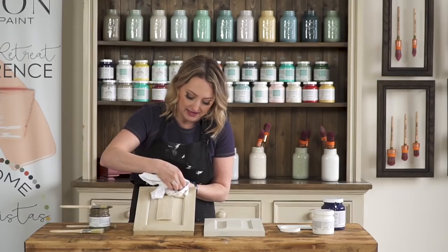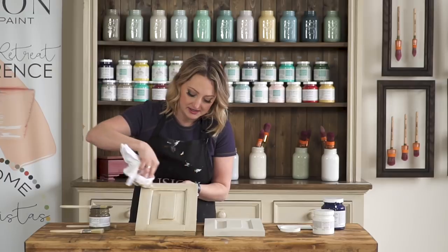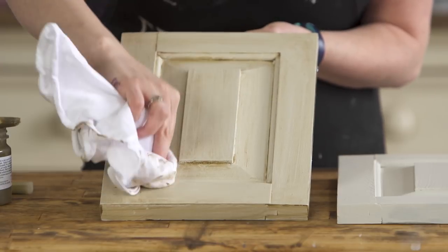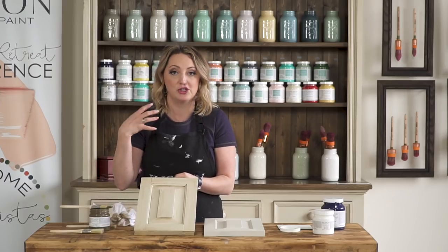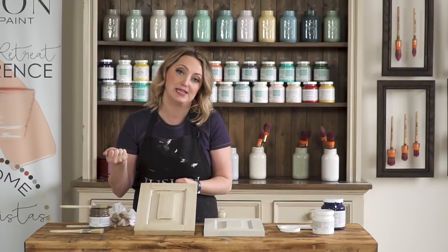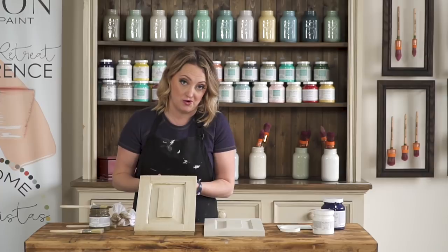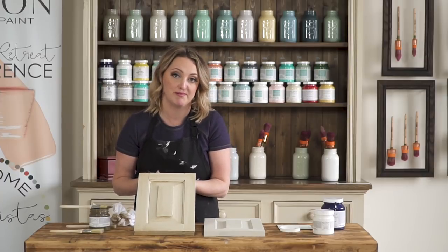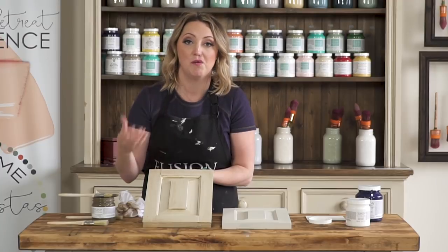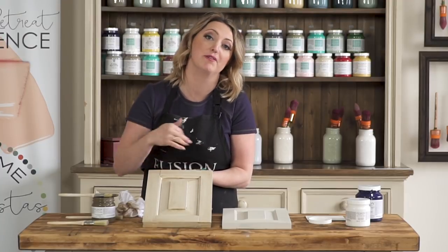What we must keep in mind is that the glaze has a very long open time and it's not as sturdy and durable as the paint is itself. So you actually will want to add a clear coat top coat onto this. I recommend using the Tough Coat, which is the non-yellowing clear coat that is water-based. You want to wait approximately 24 hours after applying the glaze to put anything else over top of it, because if you add anything too soon, it will reactivate it — any water-based products will reactivate it and you'll actually end up removing all of it.